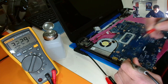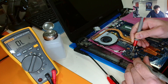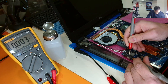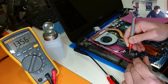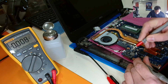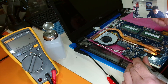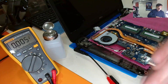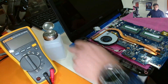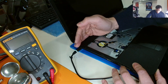The power button is now at 3.2 volts. 19, 19 — I think it's okay now. Let's measure this MOSFET: 13 volts. This is more normal to me because it's the battery connector. Yes, 13 volts. Let's put it back on the case, connect it and try to see if it powers up.